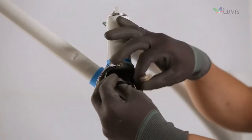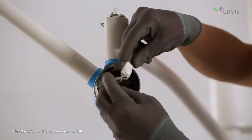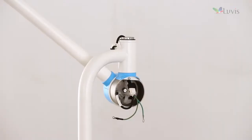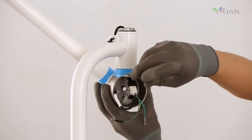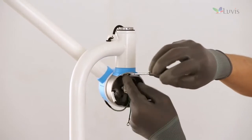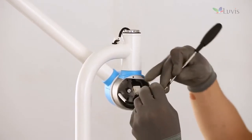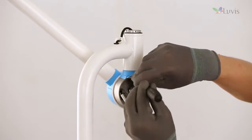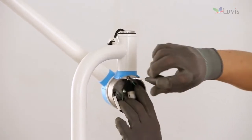Open the first horizontal arm's tension housing cover. Once the cover is open, you may see the vertical arm's wiring. Connect the vertical arm and the first horizontal arm joint wiring connector. Check the FE wire at the joint. Completely release the screw and washer mounted to the first horizontal arm joint with the plus driver, then put the release screw through the two FE wire ring terminals and tighten it again. Fix the FE wire to the place where the first horizontal arm joint screw was, using the plus driver.